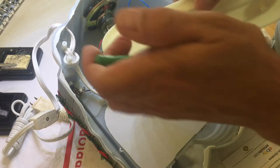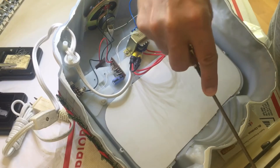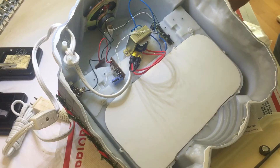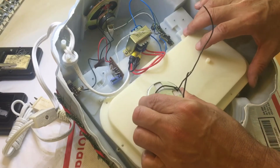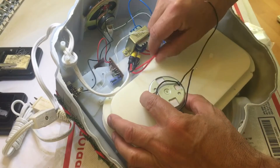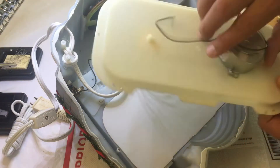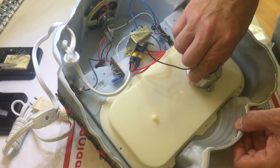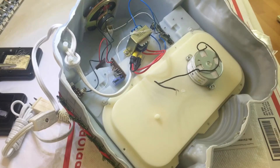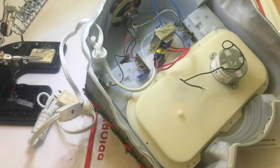Let's install the plate back onto the top. Tighten the screws on the motor but do not over-tighten as you do not want to break the plastic. The unit will only go in one way as it will match up with the tabs in the top unit. As you can see we had it in reverse, so the bottom piece will go the opposite way. Once you have the top plate and the bottom plate lined up, put the screws back in. Do not over-tighten the screws as you do not want to strip the holes.